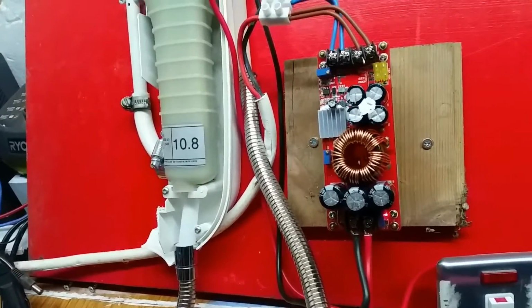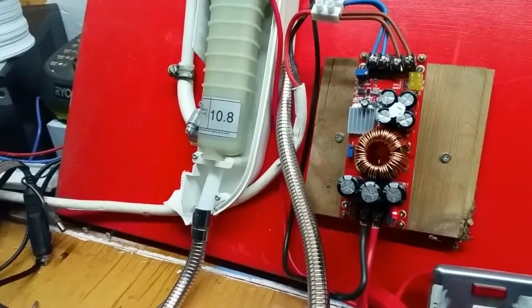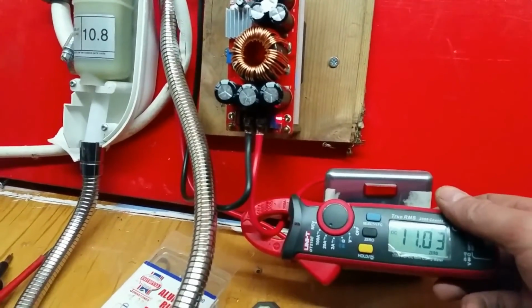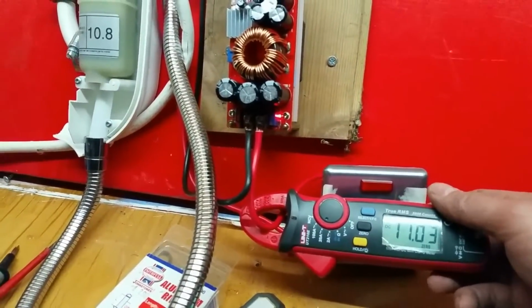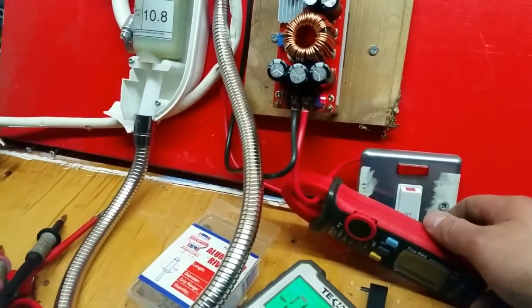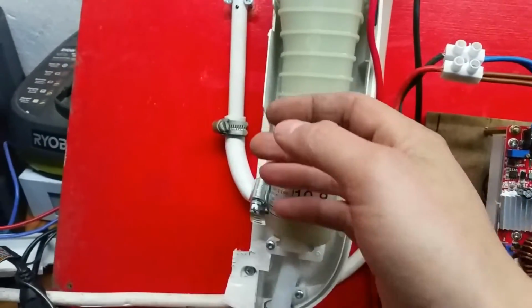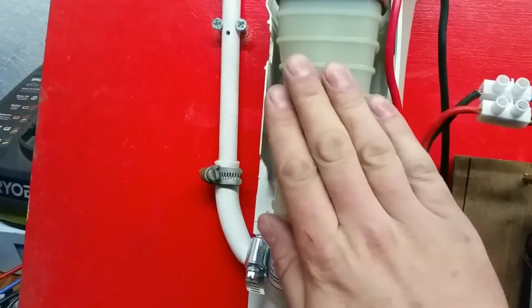So, interesting. Right, that was my bad. I hadn't actually turned up the constant current part of it, so it was just 24 volts at 5 amp. So that's interesting because we covered 2 tests already. So once we turn that up, we get 11 amp at 54 volts now. We're pulling, come on, please focus, 29.5 amps, which is right on the verge of the 30 amp fuse I have in there, so I don't know how long this is going to last for.